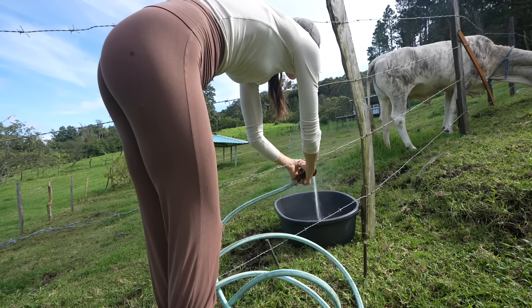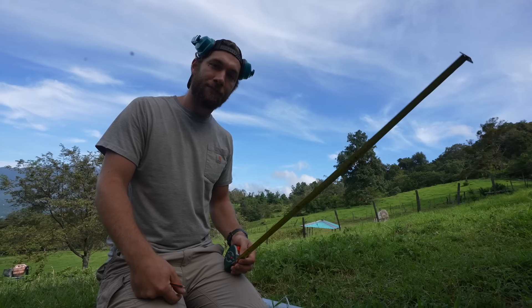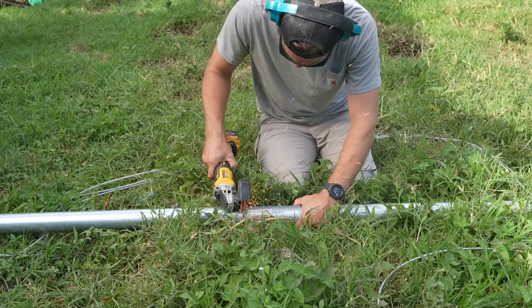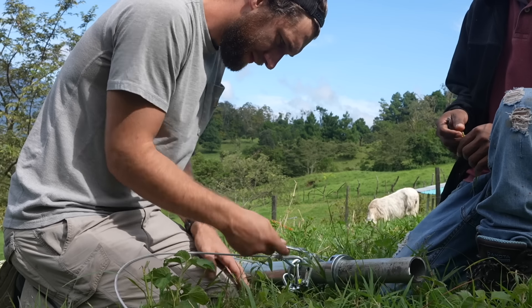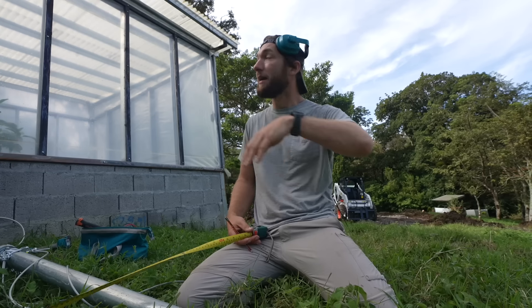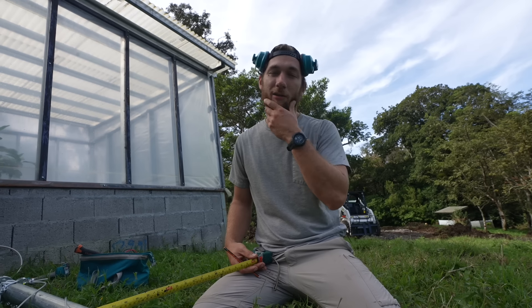We're trying to install a wind turbine onto a pretty big slope of a hill. The first thing we're going to do is take a hit on efficiency but go for safety, and cut five feet off of this — it's going to make it much more manageable. The reason we want it so tall is to prevent what's called dirty wind. Ideally you want the turbine to be 30 feet above surrounding objects like the hillside and the greenhouse. We're not going to hit that, so we'll lose some power generation, but this is the best we can do.